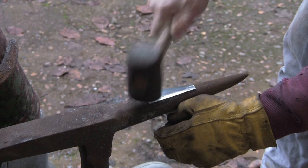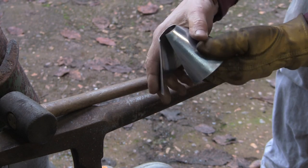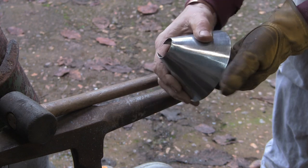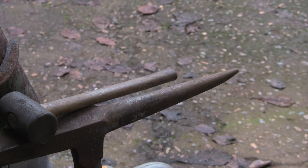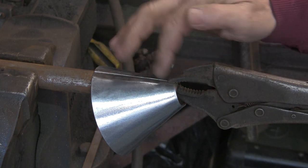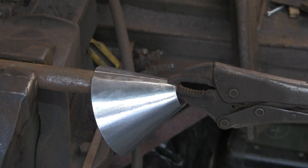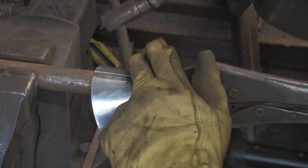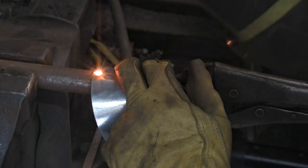It's just time, it's taking your time. It's feeling a little bit better. Still not quite closed up enough, but you can see the top is a slightly better shape now. Right, I've pulled it as close as I can. I've ground off the coating on this because I don't know if it's galvanised or Zintec or something or other. I've ground the coating off and I just want to get a few tacks on it so that then we can put it round a bit better.